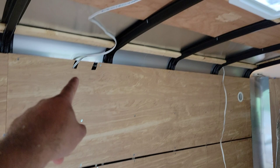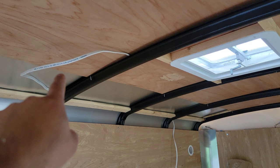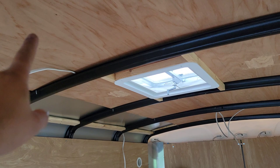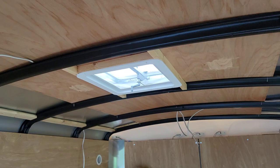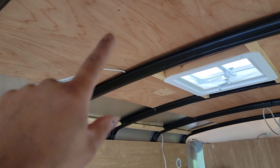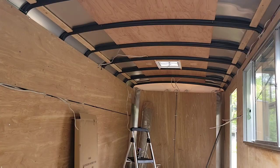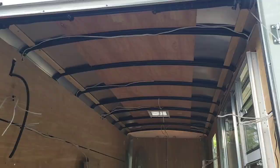The wire goes straight up and through the roof once the hood is installed. Here I'm using 14-3 cable because I'll use that switch leg for the exhaust fan going up there, and I'm leaving an extra wire up there in case whoever gets this trailer wants to add an AC unit — they'll have a power wire ready to go. Always think about expansion. It's easy and cheap to do it now. For the can-to-can runs, make sure you leave enough loop inside the wall cavity so when you bring up the stainless steel, the edge doesn't nick the wire.